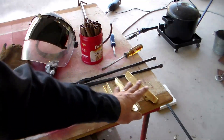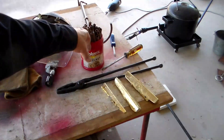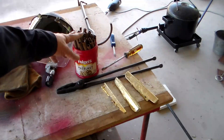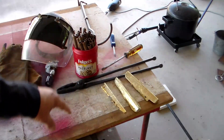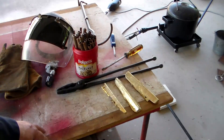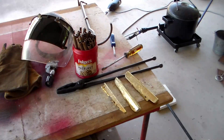Here's what I ended up with — I got about two and a quarter ingots. I already cut my copper up and I'm going to make another batch. This next one is going to be about 1,200 to 1,300 grams of copper — I'll have to weigh it to make sure, and then I'll add the proper amount of aluminum to that. Hopefully I'll end up with about five, maybe five and a half ingots to use in a future project. I'll take you out in the sun so we can get a better look.